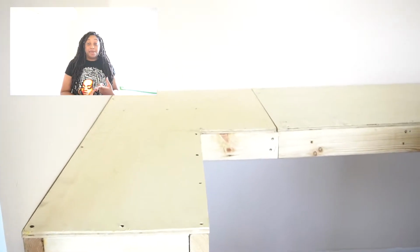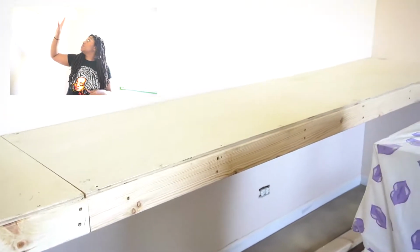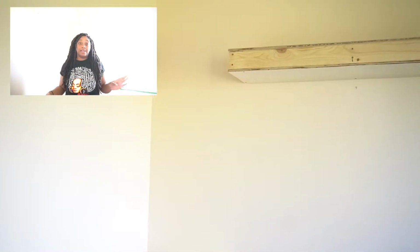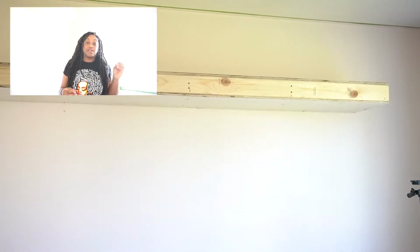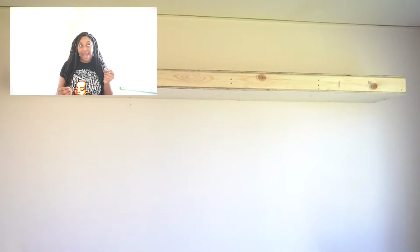And then I'm going to do some type of banding for this box, because one, I need to be able to stain it. Two, I want a finished look. I don't want to be able to see these screws or any of this premium cut wood. Nobody cares about that. I want to encase it, stain the whole thing, and put a polyurethane gloss sealing over it to make it just, you know, that.